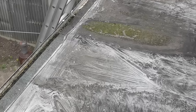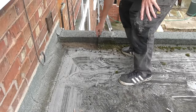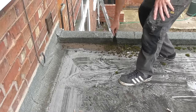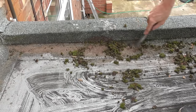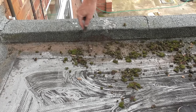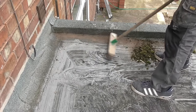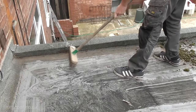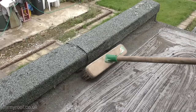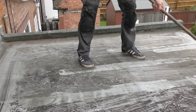It will seal the whole roof, not just small areas. The first place to start is with a clean dry roof — as you can see it's dry but not very clean. All we're going to do is thoroughly sweep the surface with a stiff bristle brush, and if any dirt or moss is really stuck that may also involve scraping with a paint scraper. What we need is a dust-free, dirt-free contact with the roof surface so we can prime it. Mineral finish or mineral edging grips onto dirt really well, so any debris left on the roof face will hinder the bond.